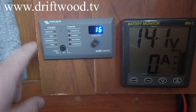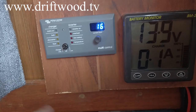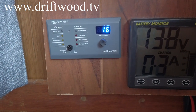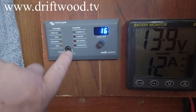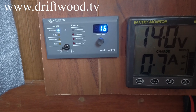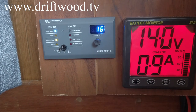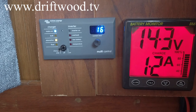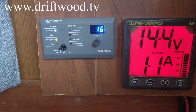On the control panel there's a little switch with three positions: charger only, off, and on. When you're on the boat and not plugged into the mains — off grid — you leave it in the on position and the inverter comes on and runs all your domestic appliances. When plugged into the mains, I put it to charger only: the charger kicks on to keep the batteries fully charged, and the power to all the sockets comes directly from the mains, not through the inverter.